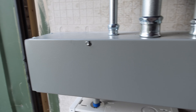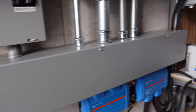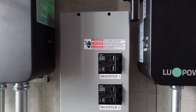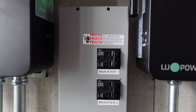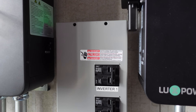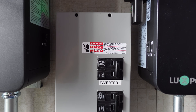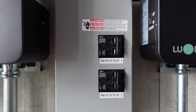Those are going down to a wireway — a six-inch by six-inch wireway, five feet or 60 inches in length, running the full span of both inverters all the way over to the battery shelf. In between both inverters, I have a small Siemens panel where the two inverter AC outputs are combined. This is the first time I've used Siemens panels — I typically go for Square D home line, but I actually like Siemens a lot better. I like their style of breakers and the terminals on the breakers much better than Square D.